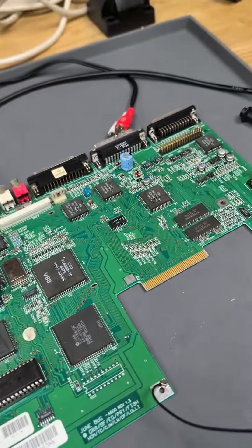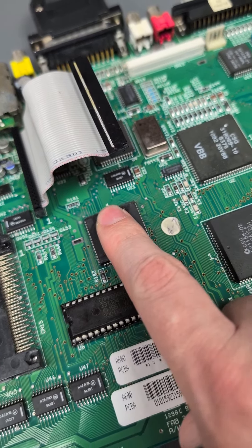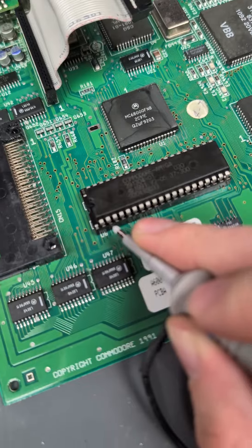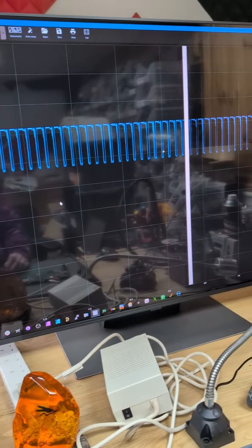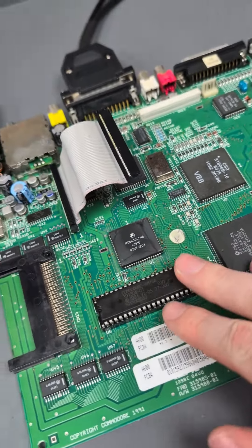So next I'm going to suspect some major fault, probably the CPU, which is quite warm, but we're using an oscilloscope to probe around. If we check the kickstart ROM, the signal is floating above 2V — that's the sign of some dead CMOS gate. You can see it's the same everywhere, so it's all this floating signal. Checking on the 68K, we obviously get the same, because all the data and address lines are tied. So there's definitely a failed component here.